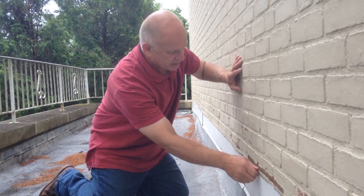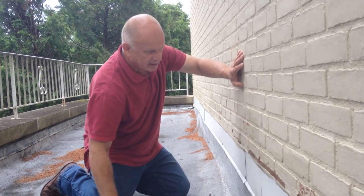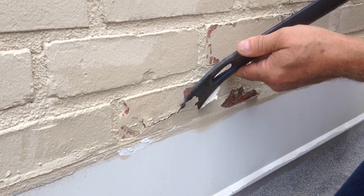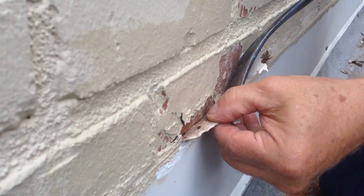So we need to correct this. We're going to have to remove all this caulking, the old caulking and the paint. But this paint will peel — look here, water went in right here behind the paint. See there? And that funnels the water to behind the flashing.